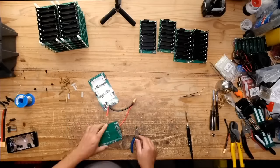Anyways, as you can see, that is taking shape there. Look at that battery box with the ribbons going on there. I always hate to cut those ribbons, because I'm like, oh, I could use that for a meter. If I want to put a meter, where do you connect the meter to get power? Well, both sides of that ribbon, the farthest connections, have the full power from the boards. So you could use it as a metering thing. Obviously, it wouldn't make sense to do it there because you would want to know if the BMS is on or not. If the BMS turned off, you would want the meter to go off.